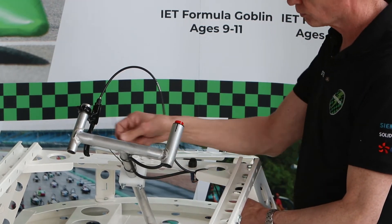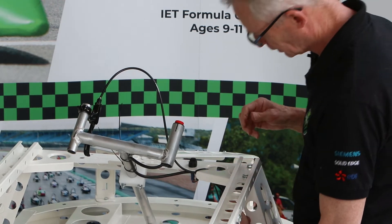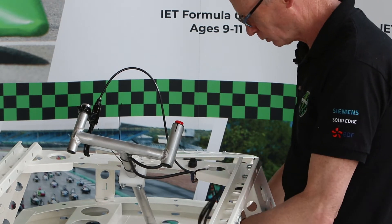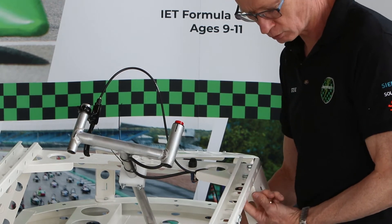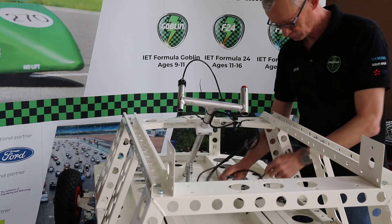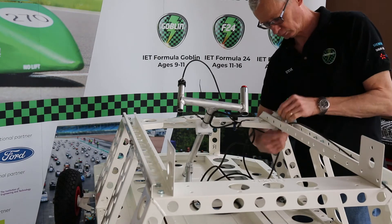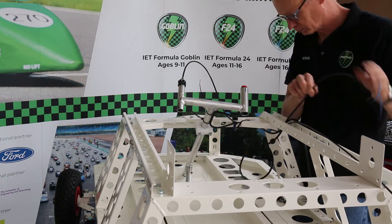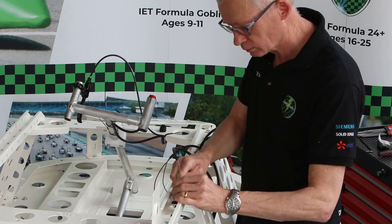We can go back and cut the tails off the cable ties once we've got them all in position. So now I've got three cables coming through here, and what I want to do is route them through my grommet. I'm going to come up through the front grommet, along the chassis rail, and down through the rear grommet — do those one at a time. It gets tighter getting these through the grommet, but it's all possible. Make sure these don't end up twisted and looking untidy.